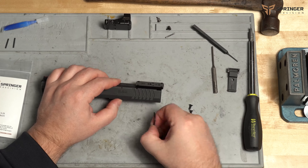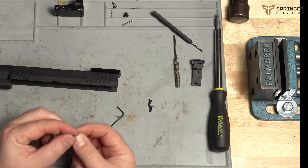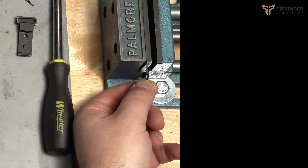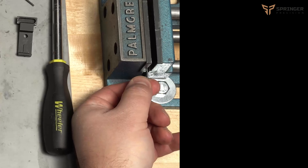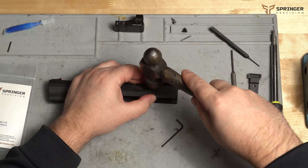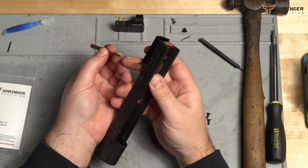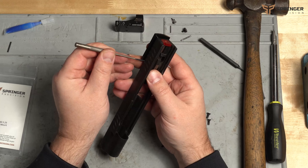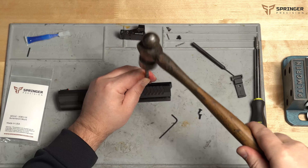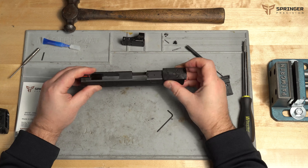The next part: we're going to flip it over and you'll see there's a little hole here. We're going to take and modify one of the roll pins that comes with it so that it can fit in that hole. The easiest way is to take it in a vise and pinch the end — make sure it's still round — and just tighten it over a little bit so that it can get started nice and easy. Then we're going to put it in the hole, give it a little tap to start it, and use our roll pin punch. The roll pin punch has a little concave area so it keeps you from smashing over your pin. Makes them go in nice and easy. Once it's in, you have this screw and this roll pin to keep it secure.